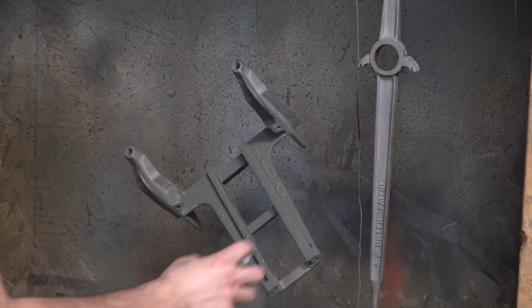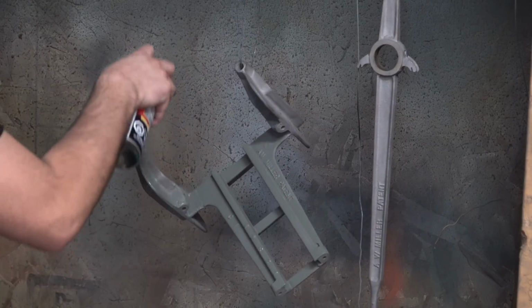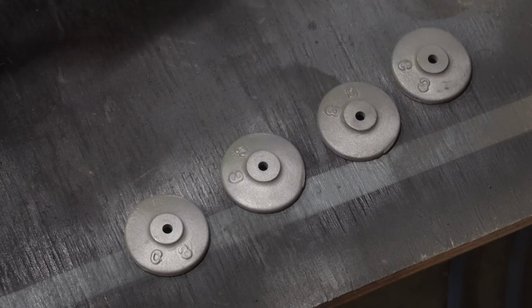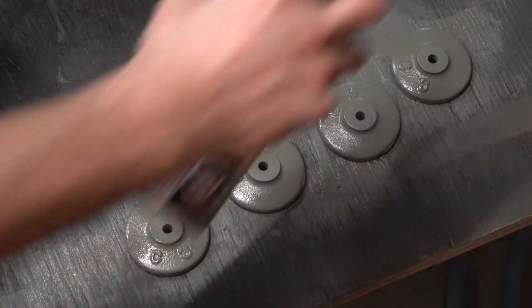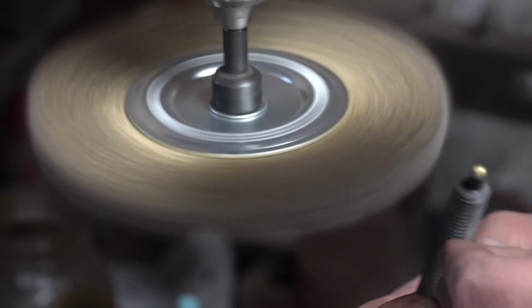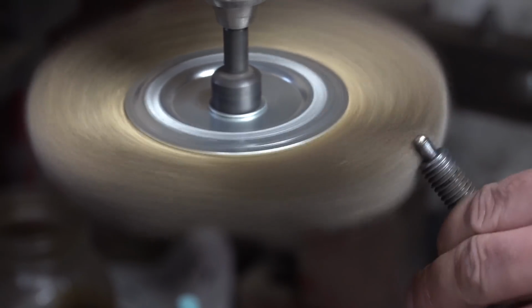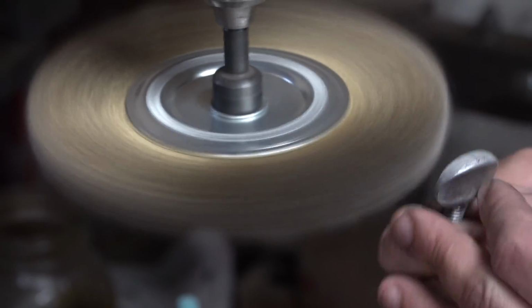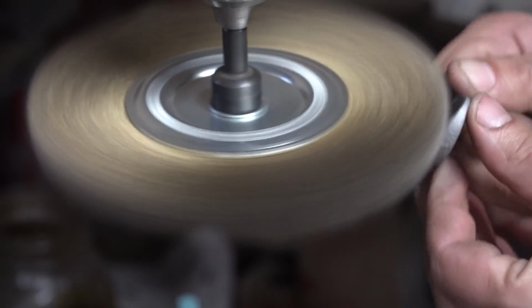I always go with an acid etching primer first, even if it's not aluminum, which would be the normal use case for an etching primer, just to get the maximum amount of adhesion I can onto these metal parts. I also leave them in a sand-blasted finish to give that extra texture, so there's even further chance of maximum adhesion to the part.